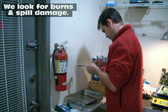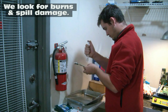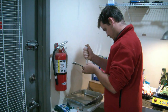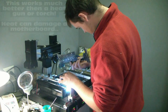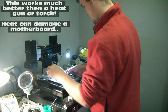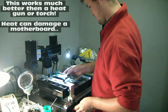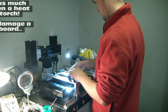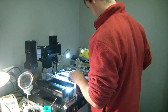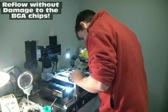We'll try to work that out with the dark IR station, but it came in for the video issue and that's what we're going to be concerned with right now. What you guys are looking at is a black or dark IR reflow station. ACHI makes this one — this is the SE Pro — super top-of-the-line reflow station. It makes life a lot easier and makes sure that it thoroughly reflows those solder beads on the other side of the BGA chip or the NVIDIA chip.